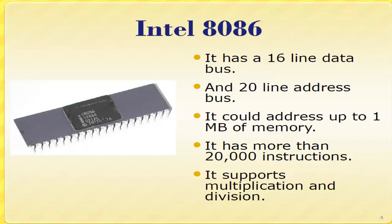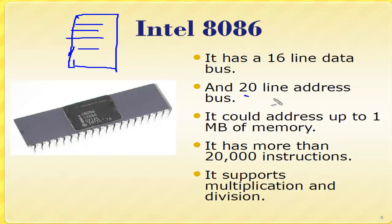One of the most important features is the bus: we have the address bus and the data bus. The address bus has to fetch the memory addresses. If you have memory, it has addresses, and depending upon how many bits you have, that much memory you can have. For example, on some old laptop you say, I have only 2 GB RAM, but if I want more, I cannot. It depends upon how many address bits you have in a processor, that is, how many addresses it can generate.